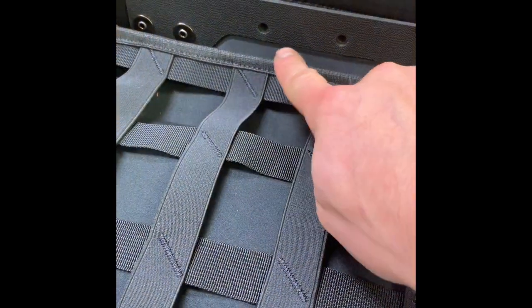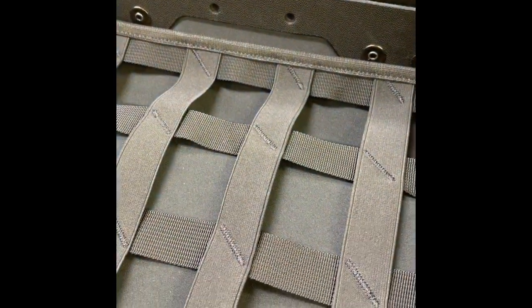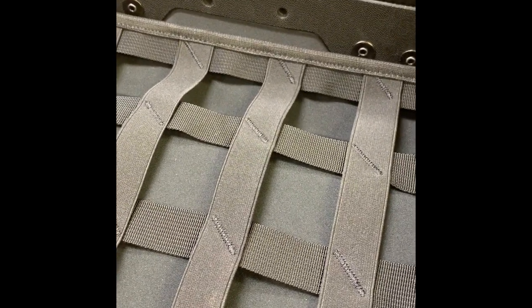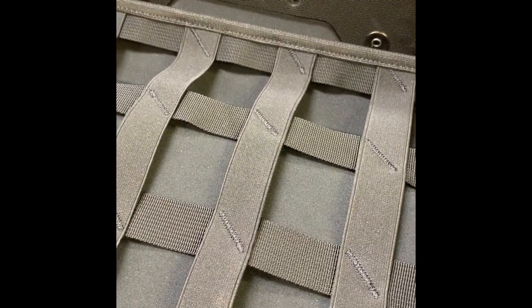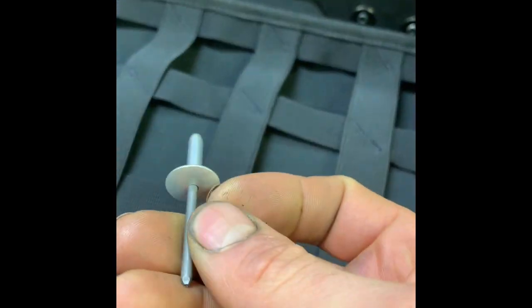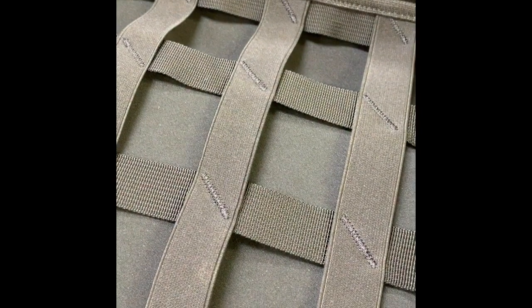BCA has made pre-drilled holes for the link system, so I'm going to drill those out with an 11/64th drill bit — one size smaller than a 3/16ths, the size of rivet I'm going to be using. It's a large face pop rivet, so it shouldn't pull through the fabric.